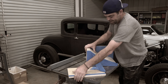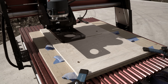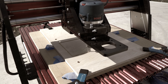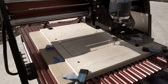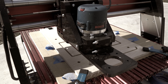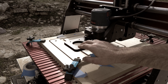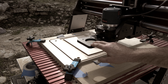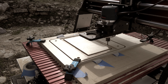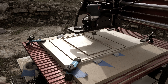With the cuts done, all I had to do was remove the homemade guides, get rid of the tape, and enjoy my freshly cut and square surface. So the chute part was done, and now I needed to recreate the spacer to get my table saw at the appropriate height. This piece is cut from two pieces of half-inch ply, but there are a couple of differences: the hole in the spacer needed to match the size of the chute's collector, and I wanted to French the chute into the spacer a bit to hide the joint. I did this by creating a pocketing path on my CNC — first time I'd ever used a pocketing path — and it went okay, but I'm still having some issues with chatter. I'm not sure if my cutting depths are too deep for my little CNC or if I've burnt up my bits trying to learn appropriate feed and speed rates.